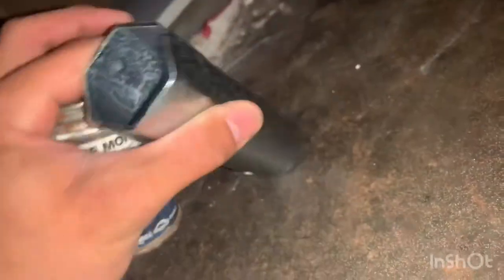All right, off the ladder. It's easier with a buddy system but when you're by yourself you do what you gotta do. Let's get my tools right here — this is a pipe socket, basically just to tighten the elements. If you put in water heaters or anything like that you know this is super handy; it prevents damaging the heating element when you're tightening it. All you need to tighten it is hand tight with that, just a little bit of torque — it doesn't need much because if you torque too much you're going to crush the gasket.